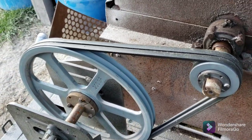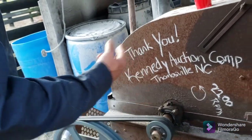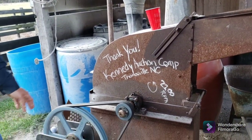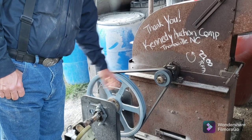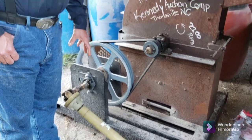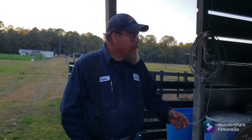Just because this may be the whole reason you're watching this video — it turns counterclockwise on this side. Best I can tell, somewhere around 2200 RPM is what you need the main shaft turning at. I went with, I think, a 20-inch pulley to a three and three-quarter inch, which gave me 2200 RPM here with the PTO shaft on the tractor turning 400. That means I didn't have to run the tractor wide open, which makes it a little quieter.